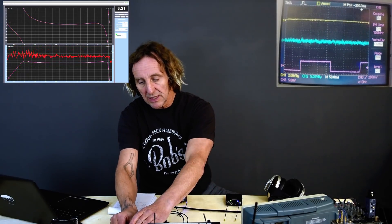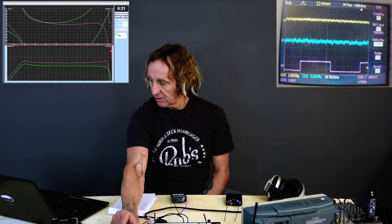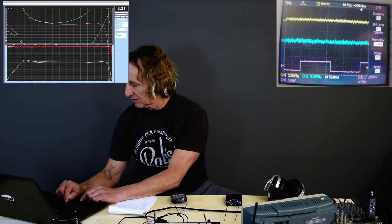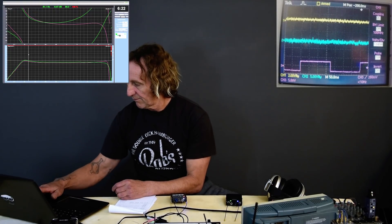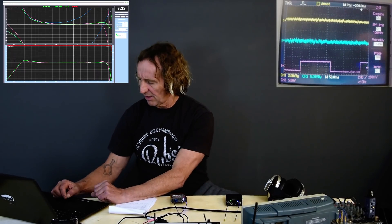Next, we'll go on to the front panel of the Shure transmitter. This is the reference point that's built into the front. The transfer function for the front panel is different — it's got a little more roll off on the front panel than it did in the pack, and a little different high-end response. Latency is now 0.06 milliseconds off the front panel, instead of 0.15 off the belt pack.